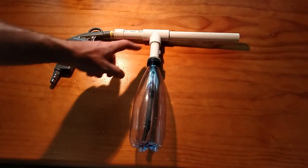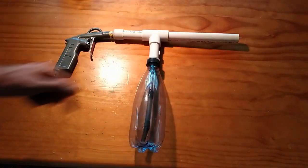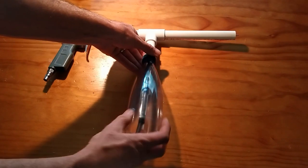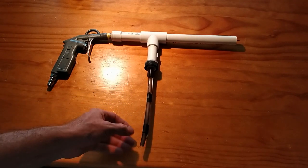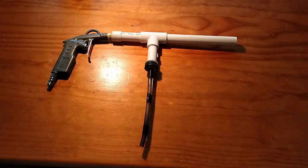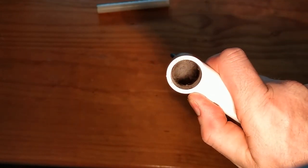The first problem is this sharp turn that I have here. With Generation 2, I've smoothed out that turn because I think I'm getting some weird eddies in there. The other thing I've noticed becoming an issue is the plastics I'm using. This tube is getting a lot of the black powder — because I'm only using black powder at this stage — sort of infused in the plastic. When I clean it, it doesn't come off and it seems to stain. And that's the same with this silicon up in here. I'll switch to a close-up so you can actually see.